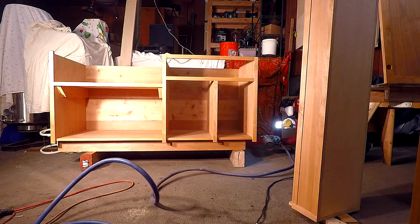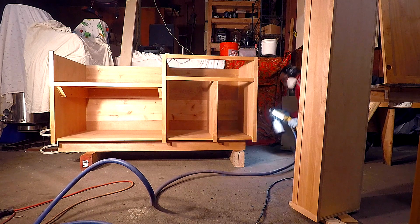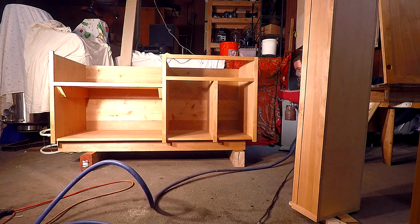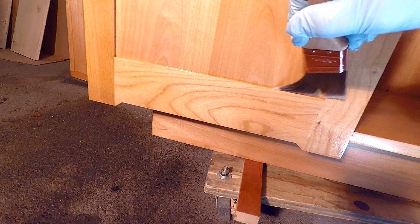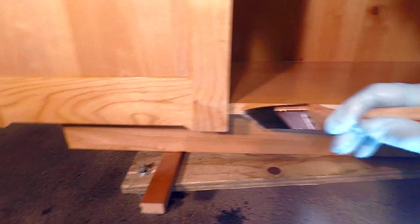I'm not going to really show or teach how to actually spray, but I want to show you my recipe for actually getting the look that I am achieving. The shellac is really runny, and so it tends to drip down, and so I'll grab a brush and just clean up where it's dripping down. And I'll even just brush the face of it. It really doesn't hurt it very much. I would not actually brush the final coats or the regular lacquer that I'm going to put on, but the shellac is so runny it just seems to be fine if I brush it a bit.